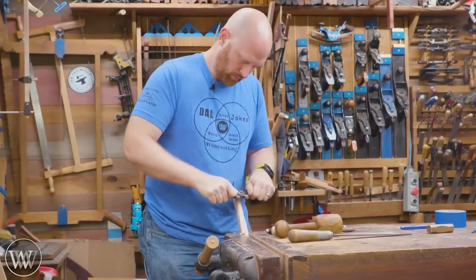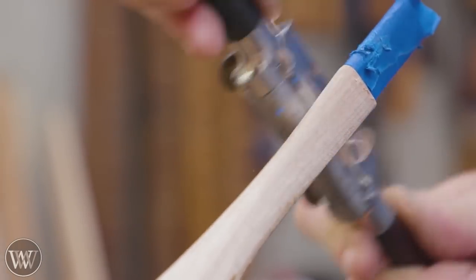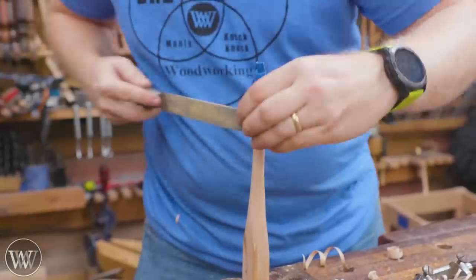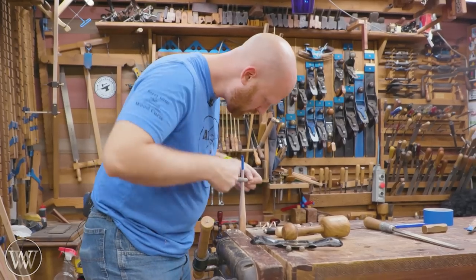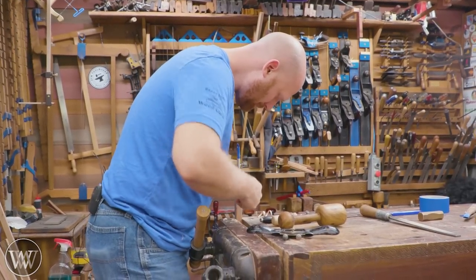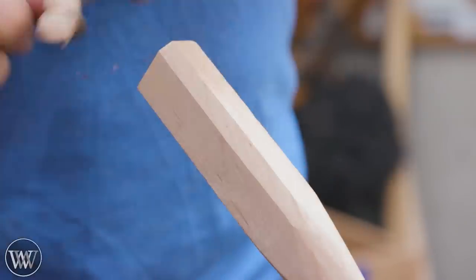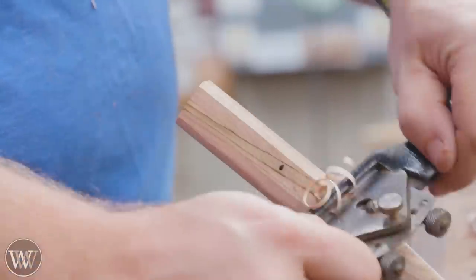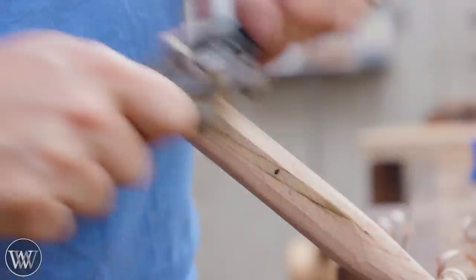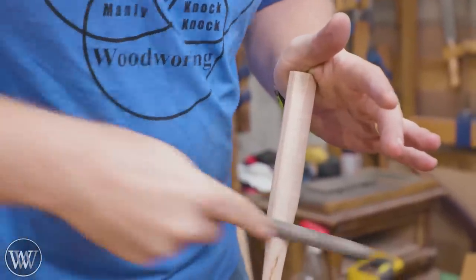Spoke shaves will be your friend here - chalk it up in a vise. If you have a shave horse, it works great, but just putting it in a vise works really well. Always go with the grain, so sometimes you're pushing, sometimes you're pulling, and you'll do opposite on either side. I'm going to get it close to the shape I want and then file it down. Up by the neck, you want it really nice and small with a little bit of bounce. This one is going to have an oval cross-section all the way down - small up by the neck, and then back where your hand holds it, a little larger. I'm going to turn it into an octagon and then knock the corners off with a spokeshave.